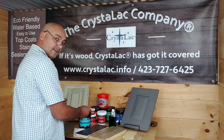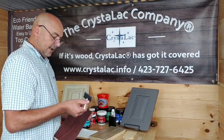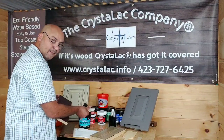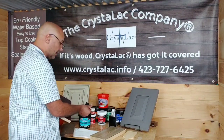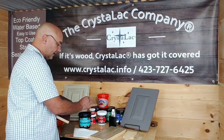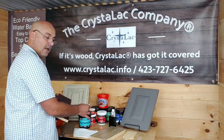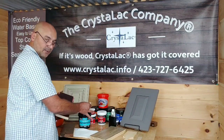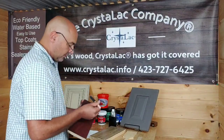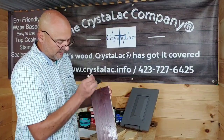I have a couple of pieces here that I had stained previously, and I just wanted to put a coat on. I've been pretty liberal with the amount of product. Sometimes I will prime my brush, especially when using a foam brush — dampen it, wet it, then shake out the excess. If you prime your brush, you don't soak up as much product as you're applying. So: dip, drip, and then just thin, light coats when using a water-based finish.